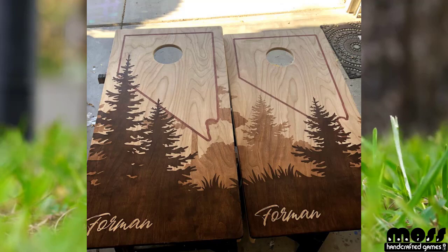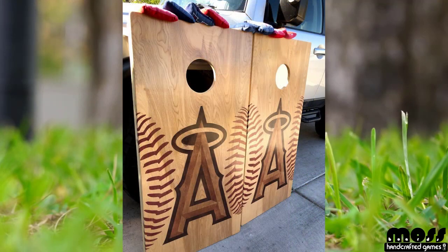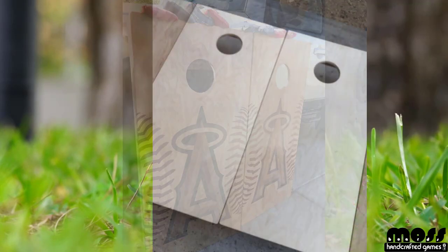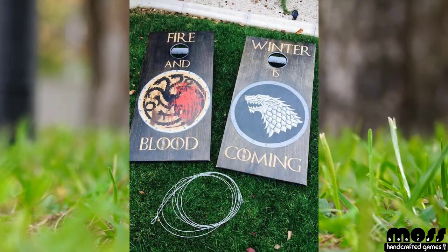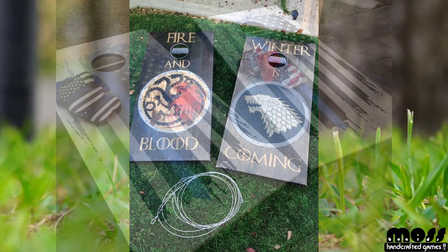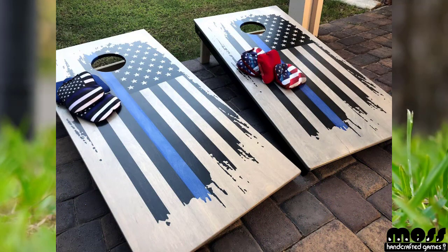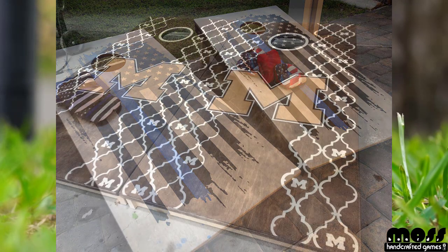At this point you've cut and prepped your tops, your frames are attached, your legs are built and attached, so now you're ready to put some designs on these boards. There are a bunch of ways to do this. Most builders are going to use decals or wraps — just print those out and slap them on the boards. I don't mess around with that. I like to use stains and paints. I use gel stains more than anything else. You can get those from General Finishes, Minwax, or Varathane. I'm not sponsored, so pick the one you like best. I probably like the General Finishes brand the best — it's really smooth, stencils nicely, clean edges, not a lot of bleed.